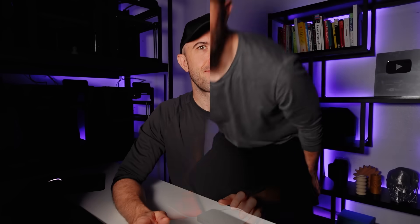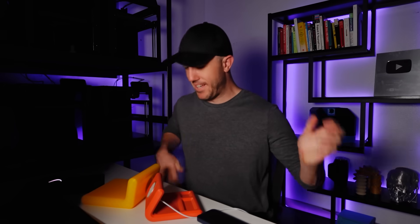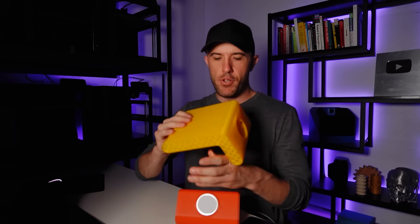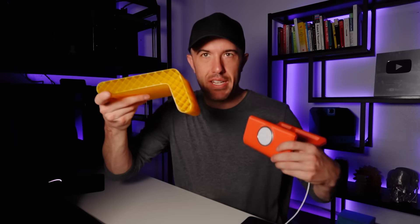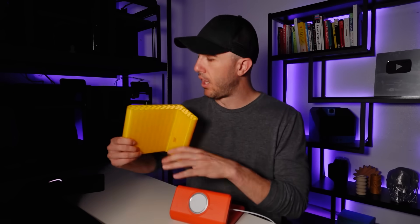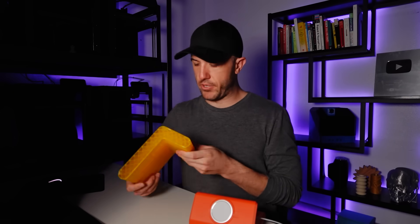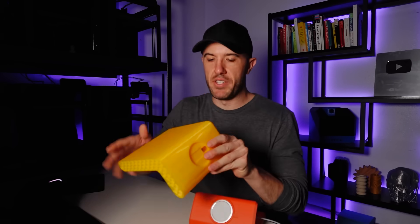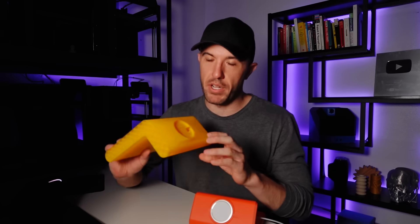Let's get to the prototypes. I got the two different primary versions — the bend-down and the bend-up. The whole point of prototyping is to get as much information as you can. I just wanted to get an idea of the form in relation to the phone in real life. These were printed with low infill just to get a quick model out, because you're going to have to prototype anything three to five times to get it perfect. Very quick prints just to see the rough conceptual stage.